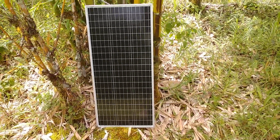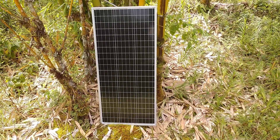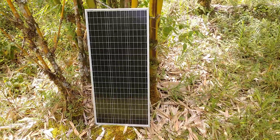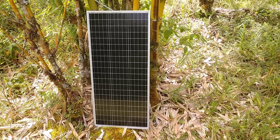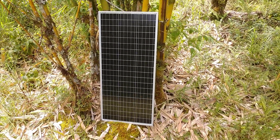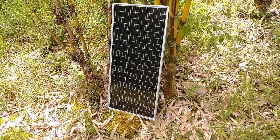Running the monocrystalline in a warmer climate seems to work better. I've run a mix of poly and mono, and mono always seems to produce a little bit better on the hotter days — I can get at or even above the stated wattage. With polycrystalline on a real hot day I've struggled to get up to what is rated. So take that for what it's worth depending on where you live and your climate, but I really believe monocrystalline is the way to go in a hotter climate.